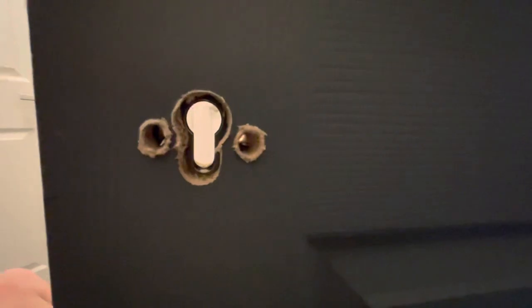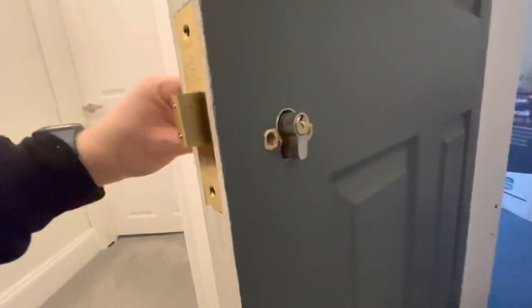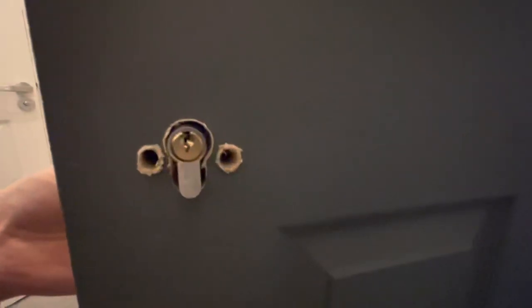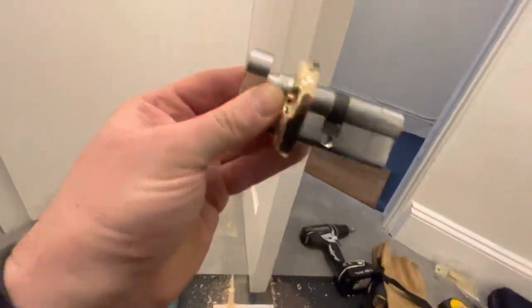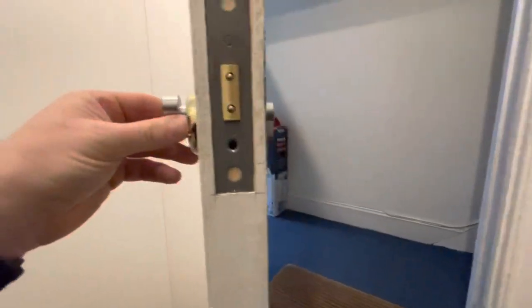So that's the lock chopped in. That's looking nice through there. I've done it before where I've tried to get the holes too good around the actual lock, and then you're struggling to get it through — I don't see the point. Always make it a little bit bigger than you need. Remember when you're fitting your Euro: if you've got a thumb turn, you need to put your escutcheon on first, otherwise you're just not going to get it through and you'll have to undo it and do it all again. So the escutcheon on first, and then you can do the screw up.